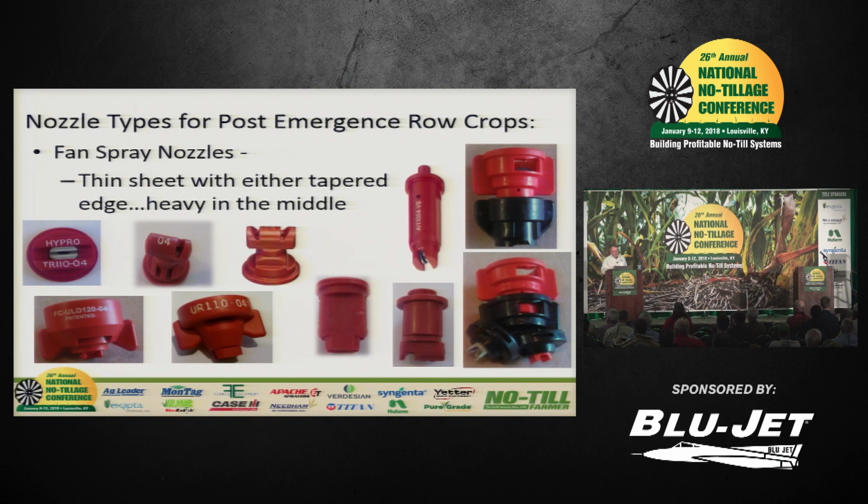And then on the far right-hand side of the screen, in the lower level, would be the nozzles that are very common today in the marketplace, and those are the air induction, as you call them, or the Venturi design nozzles, as I call them, for drift control. So the point I will start with here is that the nozzles you see on the screen are all a result of engineering design to help them have less drift, independent of operator use. And then we'll focus on that. And in my presentation tomorrow, on the dicamba part of this discussion, we will get into that focus in a little more detail as it references that process.